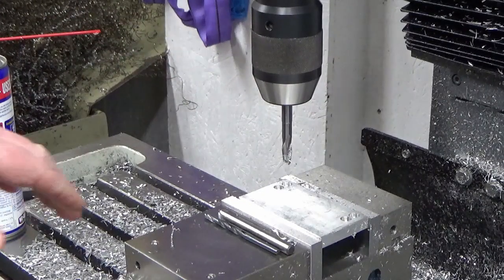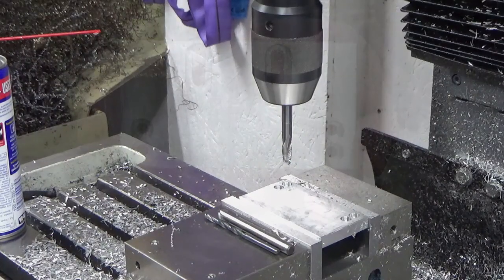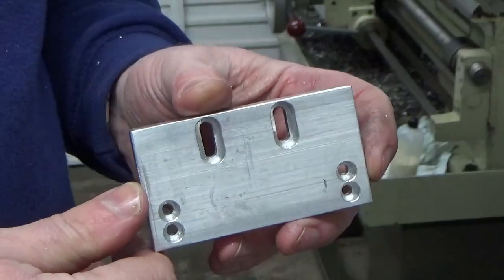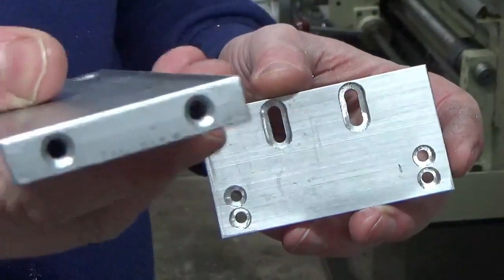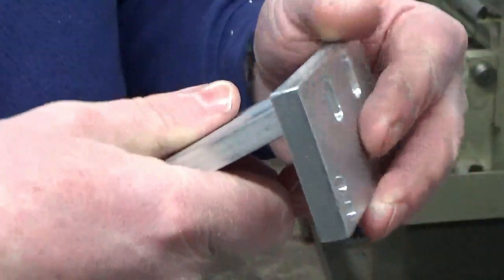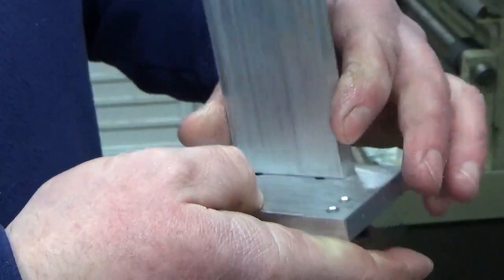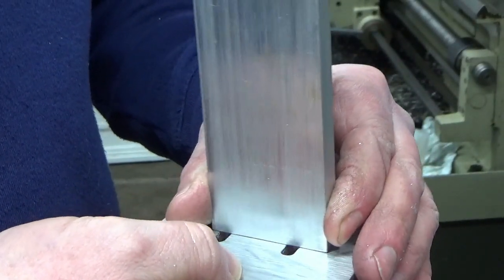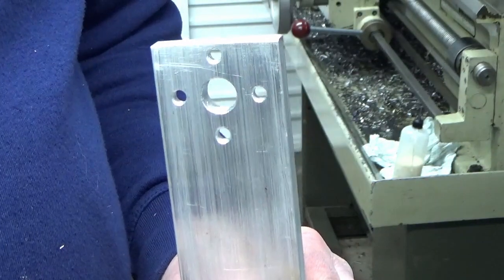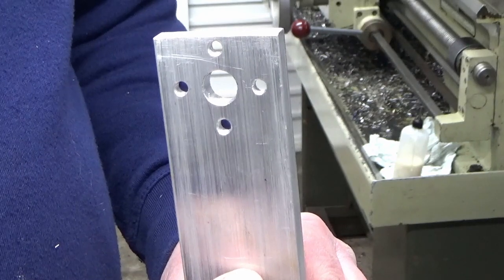That's the first setup done — that's the four holes for the reader. I've just got two more holes to drill and tap in the edge, so we'll set up for that now. Apologies — I thought I'd got the camera running and the battery died. So I've put these two slots in, and they're what are going to interface with these two holes. These four holes that I've counterbored — this obviously goes the other way up — these four holes are for attaching to the bottom of the reader. This creates the bridge. I've slotted these holes so that I've got some movement in this direction, and then this pattern here is to attach to the round boss I've already made. So we'll start heading towards assembling all of this now.